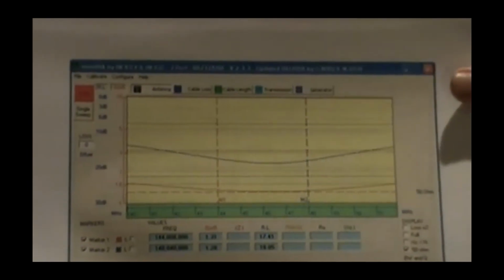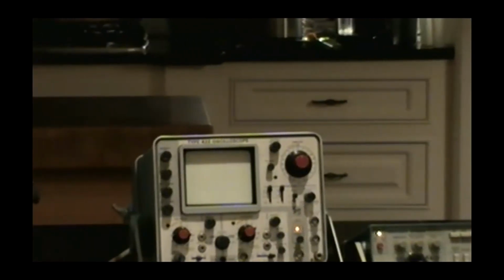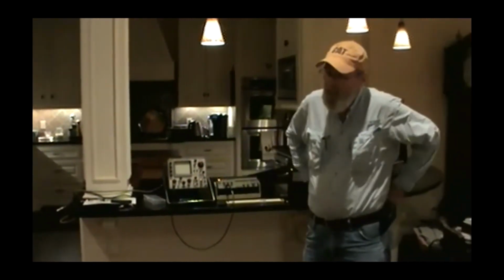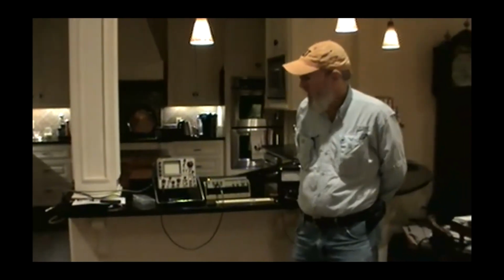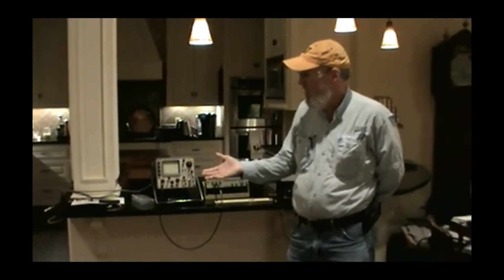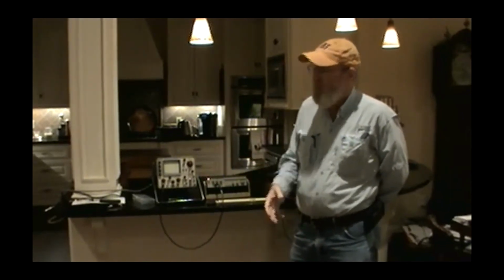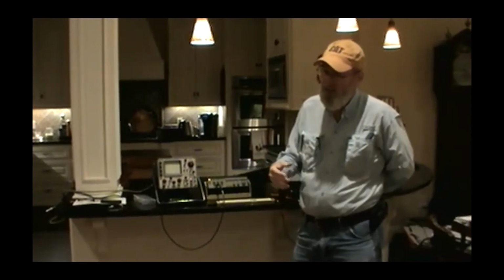This is from a 2-port network analyzer. There are a lot of versions out there. The Nano VNA, in my estimation, and Mini VNA are the two most useful that I have seen so far. This one because it's extremely inexpensive and has a built-in display. The Mini VNA is attractive because it carries a rechargeable battery. It covers from 100K to about, I want to say, 200 megacycles.